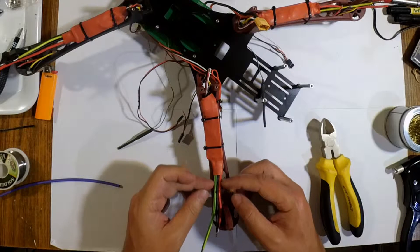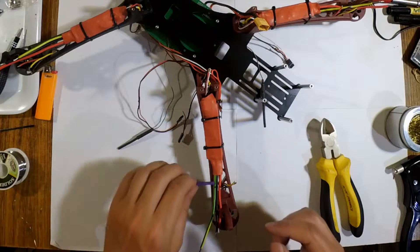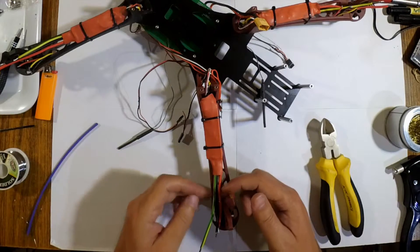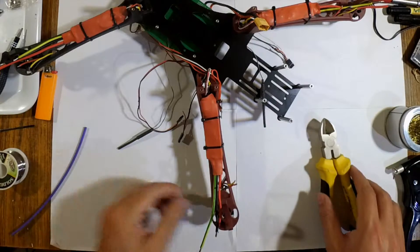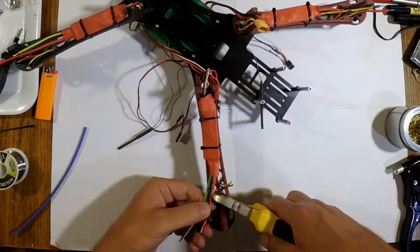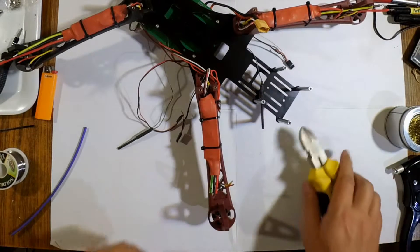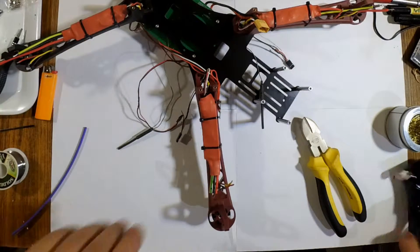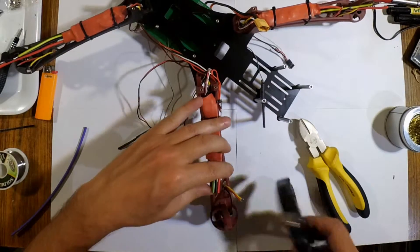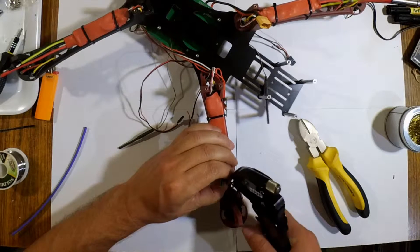I want a piece that's long enough so I have something left to actually solder onto, and also enough length to fit heat shrink without it being affected by the heat of the soldering process. I like this length — it's pretty good. I'm going to mark them all and cut them one by one. Let's get the stripper in there to strip these tips off — we don't need that much stripped.